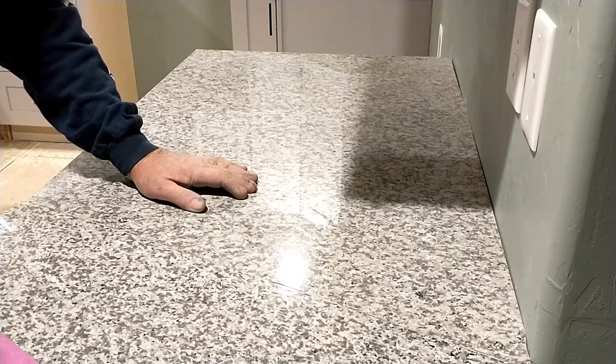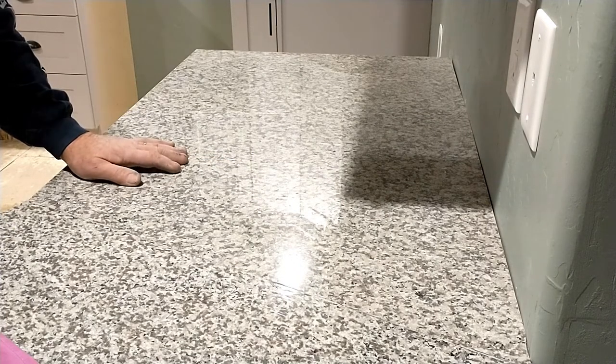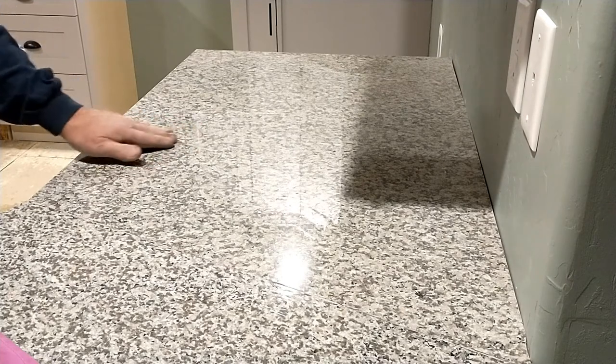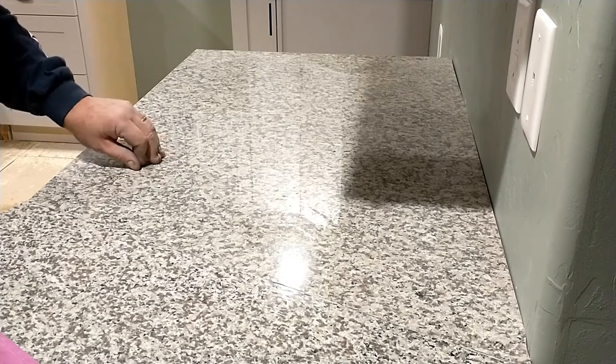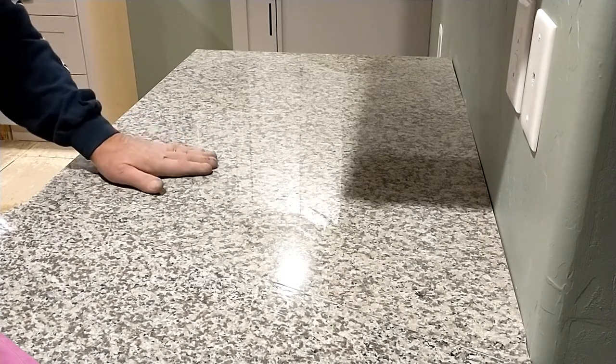And then clamping a straight edge on the granite and running the edge of the saw along that straight edge, just moving very slow, made a pretty decent cut. Probably for me, it was at least a third of the cost of having them done professionally. So for you brave do-it-yourselfers, again, this is relatively difficult skill-wise, so I wouldn't recommend it to everybody. But if you have the skill set to take something like it on, it's beneficial financially. And there are a few other videos on YouTube where do-it-yourself type folks had pretty good success. I think. Yeah, that's the story of the tops.